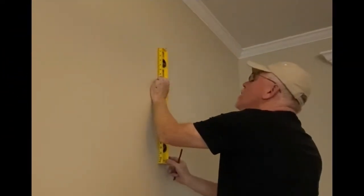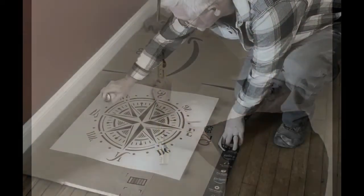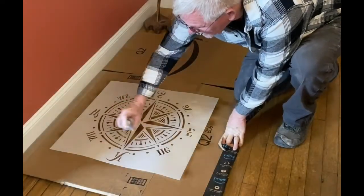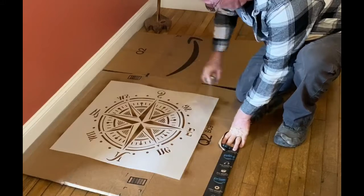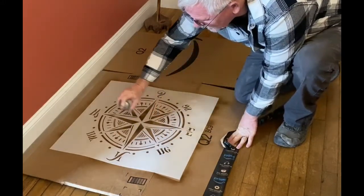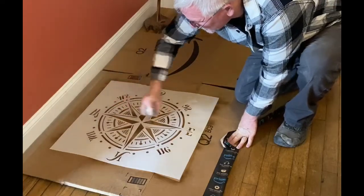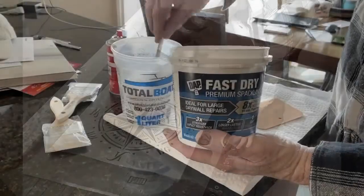The first step, I ran a line just with a level so I could get it perfectly straight up and down. I then took the stencil which I purchased — a reusable plastic stencil I got online — and I sprayed the back side with stencil adhesive. This is very important. This adhesive allows you to place the stencil on the wall and even reposition it if you don't get it right the first time.